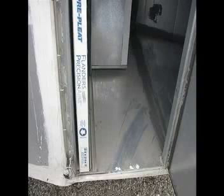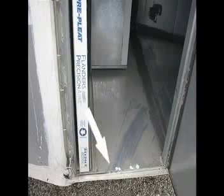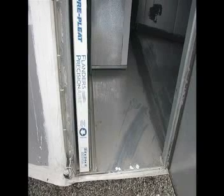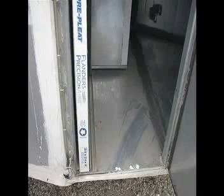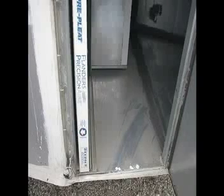rigid box. I removed the rigid box, swiped the plenum as you can see, and look how filthy these filters are allowing the plenum to get. Now if the plenum's getting this filthy, you know your coils and your ductwork are getting filthy, and that is leading to serious issues from energy consumption to indoor air quality liabilities. And this is a very common sight with these products.